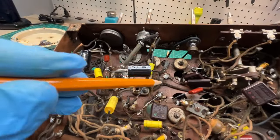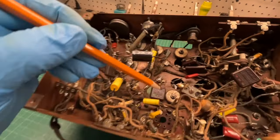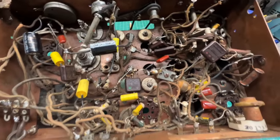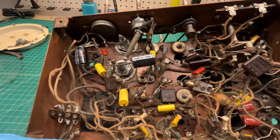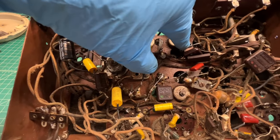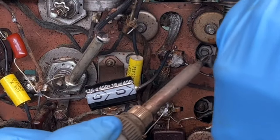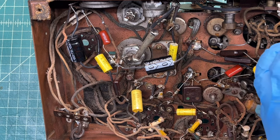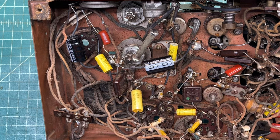We've got the grounding straps to deal with, but it should be this fastener, this one, and one more — then that should free up the tuning condenser from its physical constraints, other than the ground leads in a few different locations and the lead wires going to the oscillator coil or antenna coil. I'll leave that there as a reminder of where it goes, then go ahead and unsolder the trimmer and try to lift it from the rear section of the tuning condenser.